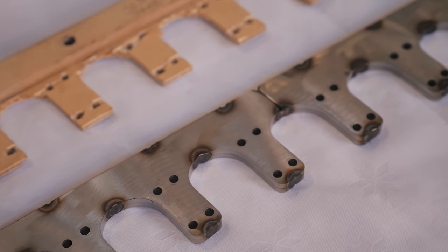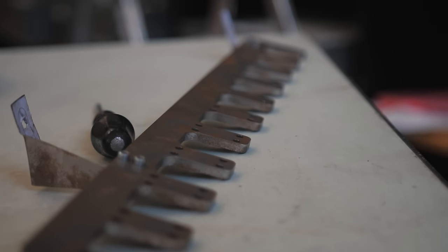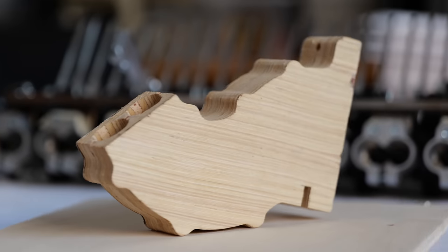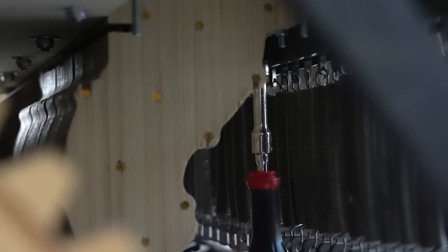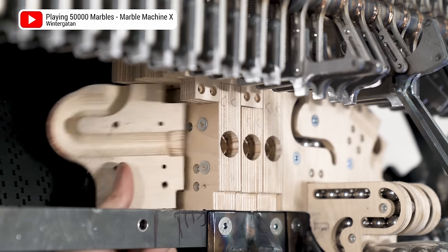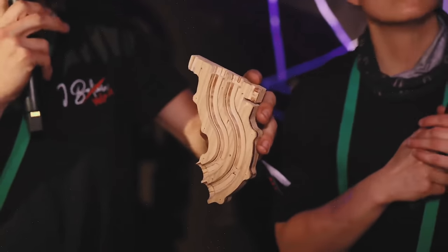The rack that the droppers are mounted on — which Martin had made — had an issue: the gates were positioned on it slightly angled. It was quite a task until we were absolutely sure the design would work. Another part we elegantly skipped was pipe bending — I think someone has a trauma from that. The pressure modules that Martin had been fiddling with weren't necessary anymore for pressure relief, as the escapement gates need pressure to work. If they don't have enough pressure, the small star won't rotate. The pressure reliefs he made were very angled such that if a marble ever got stuck, it would not go down the slope by itself again — they'd have to be loaded again.